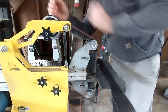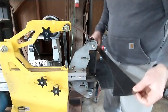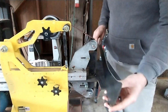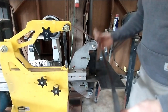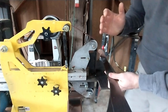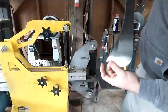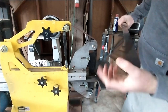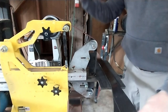I'm in the shop on the grinder with a 240 grit belt. This one had the best edge out of the box, and I think this shape is the most apt to do what I'm looking to do — it won't cut light brush but it'll go through slightly thicker limbs. I'm going to touch this up using the slack of the belt to give it a slight convex edge. It got burnt as they were grinding from this side — the heat treat on that section is spent. I'm not going to grind it to a point; I'll just get a good working edge on it.